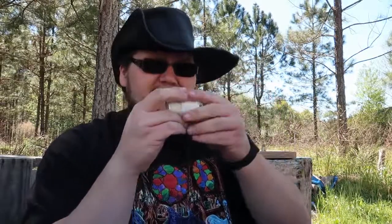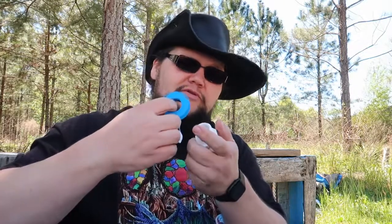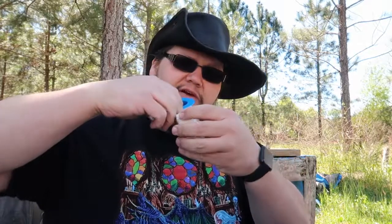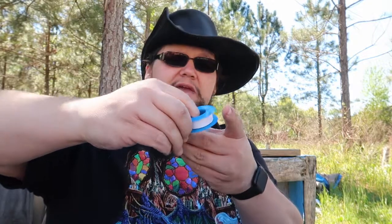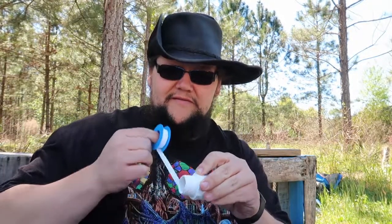So the first step, we've got to put this into the metal flange here. This is just the converter — it's one-inch PVC converting to a three-quarters-of-an-inch pipe fitting. The metal flange is three-quarters inch, but the pipes running from the aerator, which we have to have because of where we live, are one inch. So the first thing you want to do before you screw this into the metal flange is make sure you've bought plumber's tape. As this threads all the way through, that plumber's tape helps fill the gaps and seal any possibilities of leaks. So you want to wrap this around — it's not sticky, so you have to be careful. When you're threading it, hold one end down and press it down so it sinks in, then go around and make sure you cover the thread all the way to the bottom. I usually go around it twice just to be on the safe side.